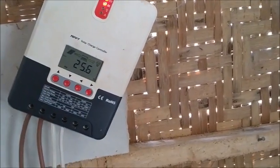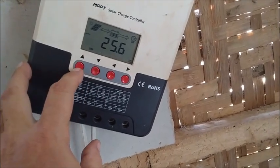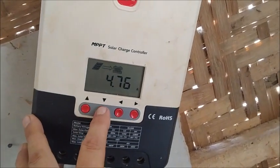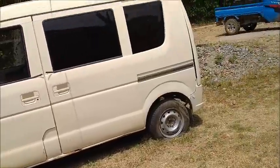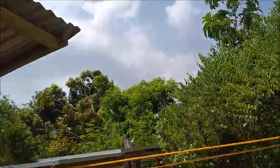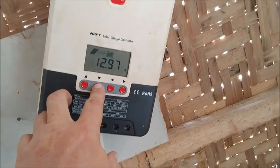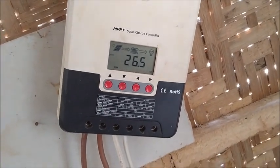I've had the house on solar for going on four hours now and it has not been a sunny day. My voltage here is 25.6V and I'm only getting 5 amps into it currently because it's not a sunny day. The sun is poking out right now but for the most part today it's been cloudy. Because the sun just came out, the amperage is already climbing back up to 13 — that's close to what it was when I turned it on.